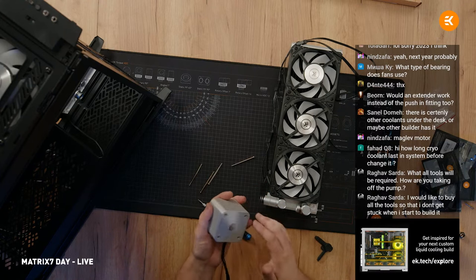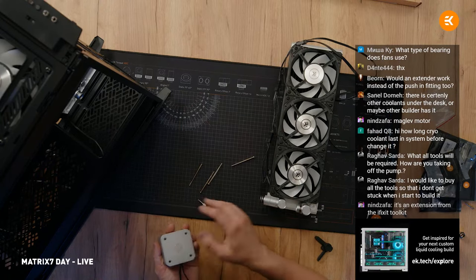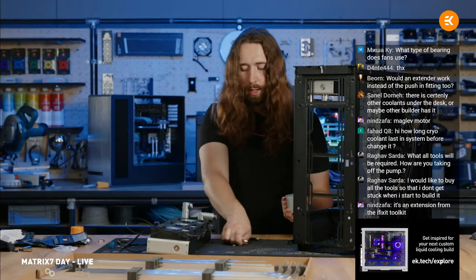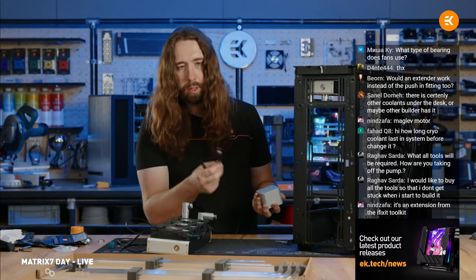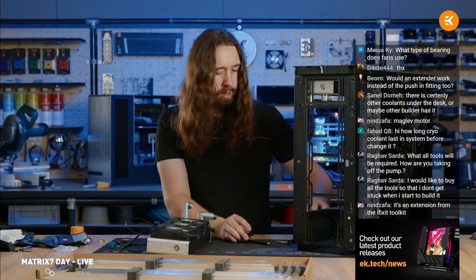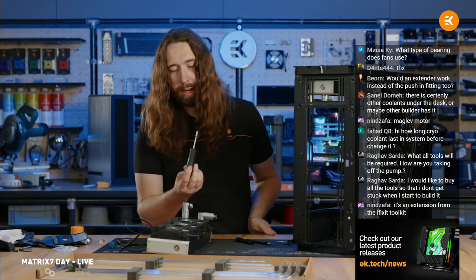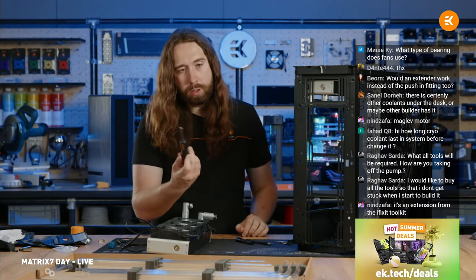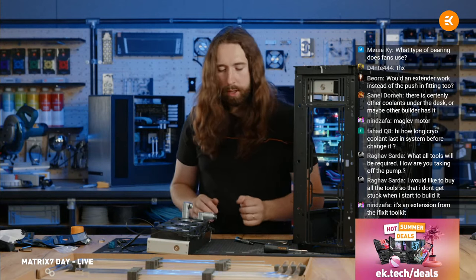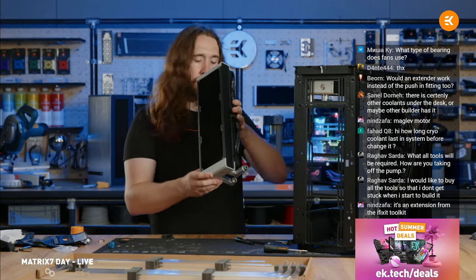So the pump is just screwed on with M4 screws. Not super tight because they're also in the plexi, so I'd used just the iFixit with a 2.5mm hexagon, and to put it back I will use a 0.6 newton meter torque screwdriver, just so I don't overdo it. Okay, now we have a bit more space for this guy.